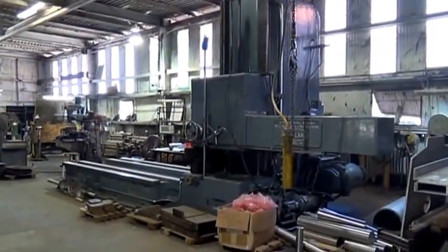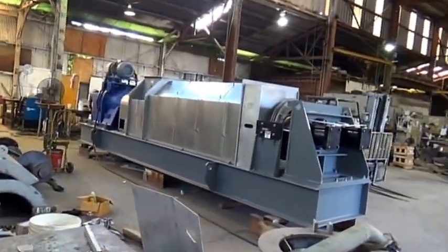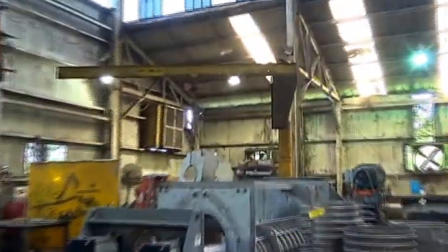We've got a machine shop — mostly lathes. We've got one big vertical boring mill where we can straighten out and get proper alignment between the screw and the gearbox. This is the assembly department. This one's shipping out today, and there's another one with the press going together. I'm waiting for the screw on this one. We've got frames for lots of screw presses. We don't build an outer press until we need it. Usually there's half a dozen going together right here, but it looks like we've cleared them out. There's a screen department over there and a frame of a press.